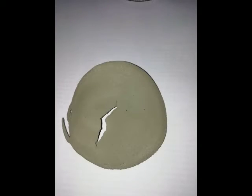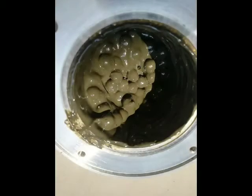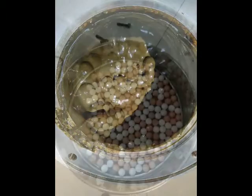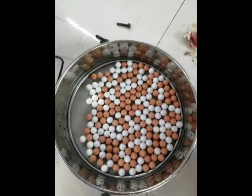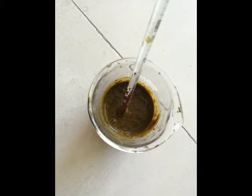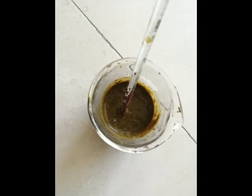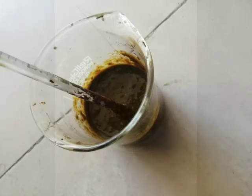The high energy grinding machine contains two grinding jars. We put grinding media in each jar. Here the grinding media are steel balls and zirconium balls. Firstly, we prepared ground cow dung under steel balls. For this purpose, we filled the jar one-third with grinding media and 10% of the grinding media volume is filled by cow dung.